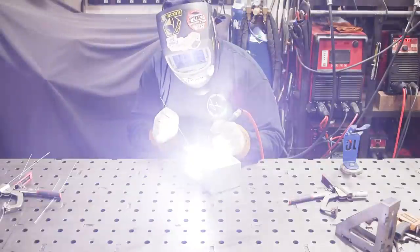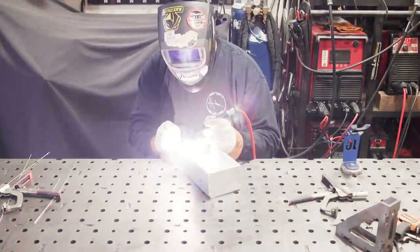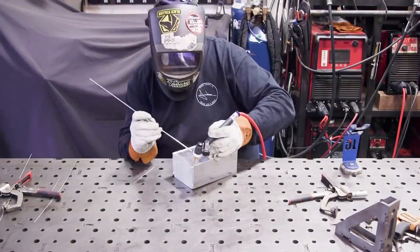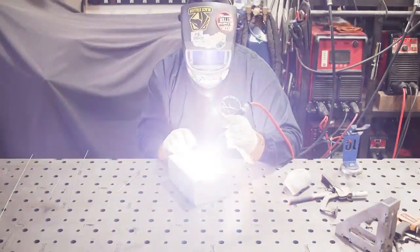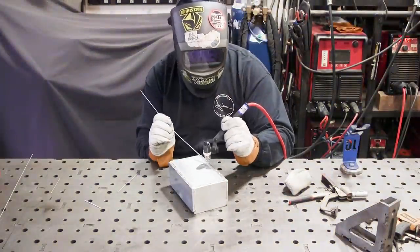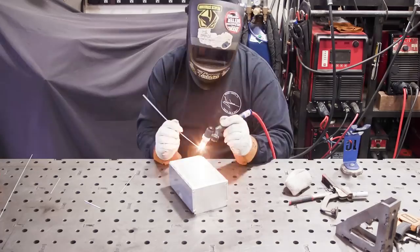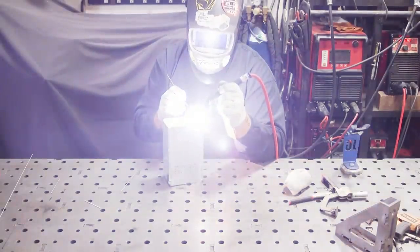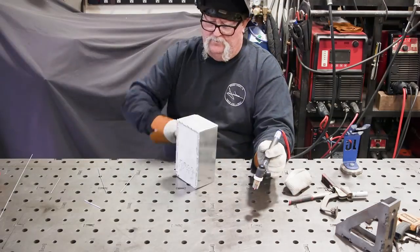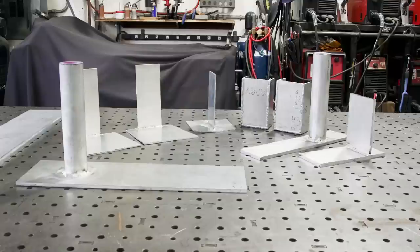I've got several of these little boxes to go. You might see I've got a TIG finger on there — that's really helpful in a small area like this when the plate gets really hot. If you've got to drag your glove across there without a TIG finger, that gets hot quick. Just finishing up the last of it. The pieces were slightly off with some short ends and long pieces — he said it wasn't important, but when I was done I ground everything down and squared everything up. There are all the pieces, all done, on to the next step.